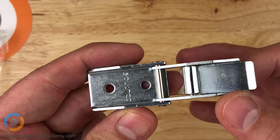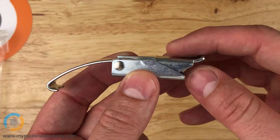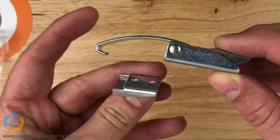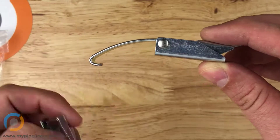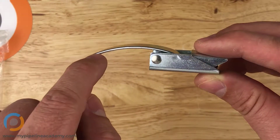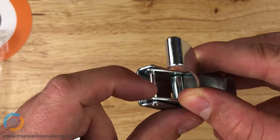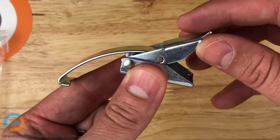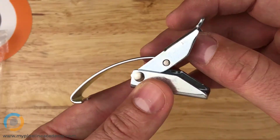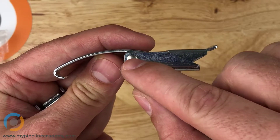Let's see if we can take a look inside and see what this looks like. One thing you might notice is that if you draw a theoretical axis over here where your catch would be, there's going to be a horizontal line between this pin right here and that catch. This pin, by the way, is the pivot axis — this whole latch pivots about that axis. As you close it, this pin right here, which is where the latch is attached to the handle, is going to sit somewhere beneath this pivot pin when fully closed.